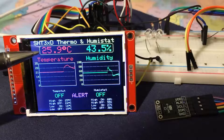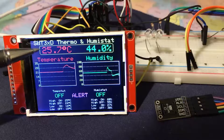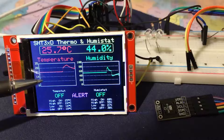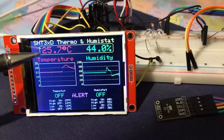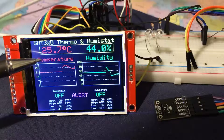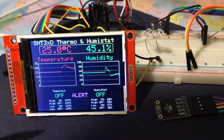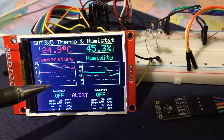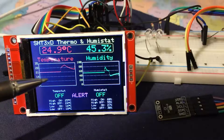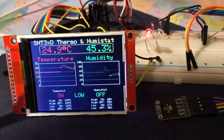Eventually, if that were the temperature of a room that's been heated up, as the room begins to cool it will then demand heat, and when that happens we'll see the status change. When 'alert' comes up it means the alert pin of the SHT31 is high.